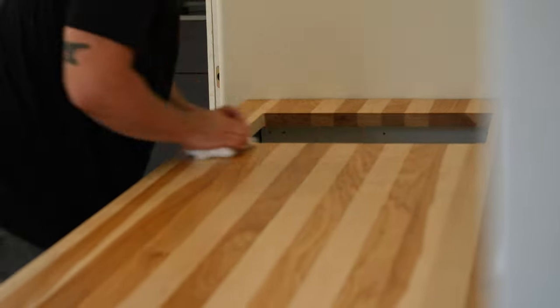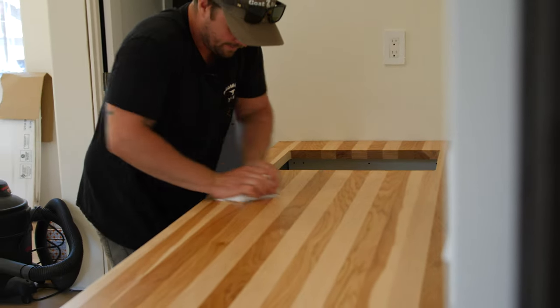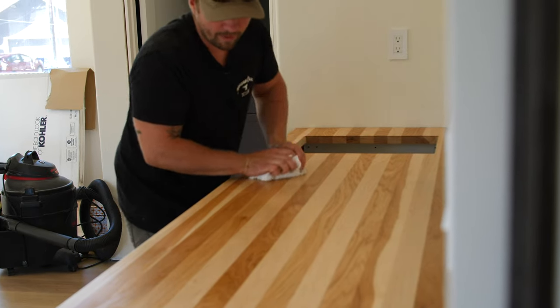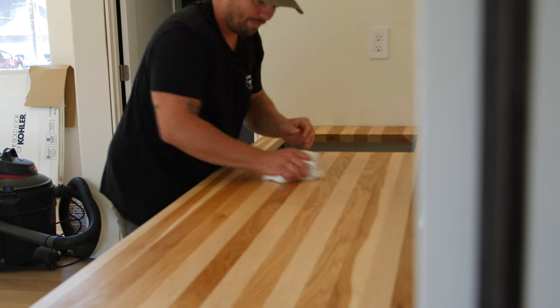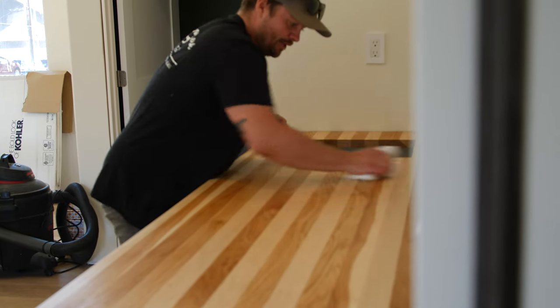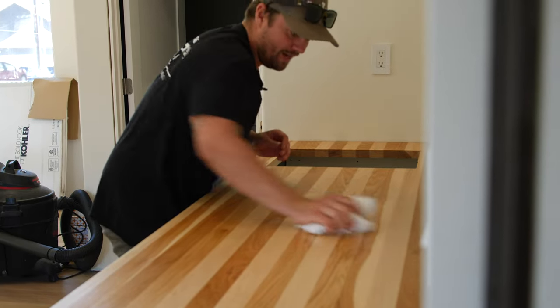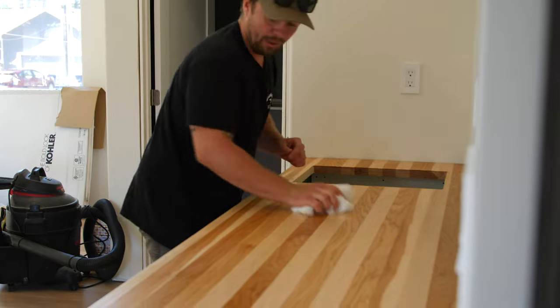We've waited about 45 minutes since we put this top coat on. We're just going to grab our clean rag and wipe down the excess oil on top. When your rag feels loaded up or saturated with the oil, just refold it to a clean spot, or grab a new rag and keep wiping it down. There's really no rhyme or reason — just taking any of the excess off the top, and you'll see it even out as you go. I'm applying pressure because you're actually kind of buffing the finish as you do this by hand. With Odie's Oil, you'll also get a pretty good workout — if you're not sweating or breathing hard, you're probably not pressing hard enough.